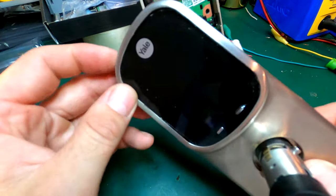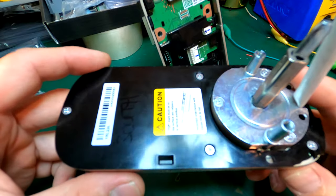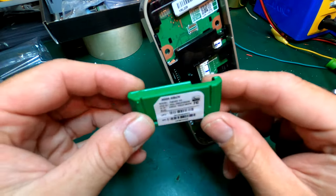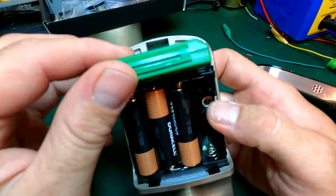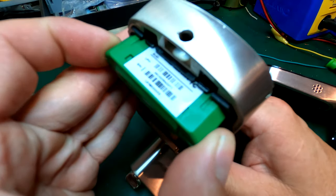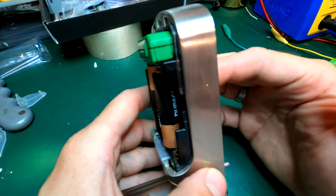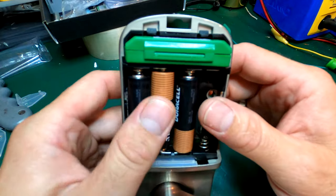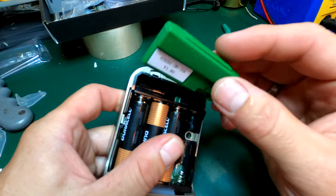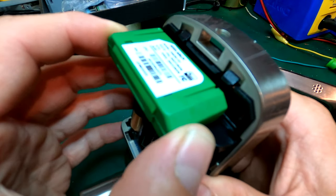Hopefully you now have a better understanding of how these smart locks work. The strike plate engagement has to be perfect — the door has to close freely and the latch has to fully engage the mechanism. For the Z-Wave module: sometimes it's easier to go into your smart home app to delete or add devices. Keep in mind that to delete a device, you sometimes have to activate the old device first — if the lock is completely dead, you might not be able to delete it properly from the system.